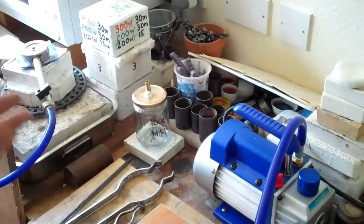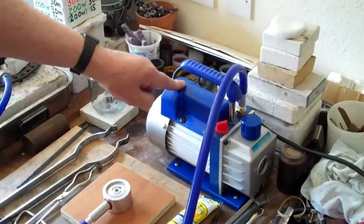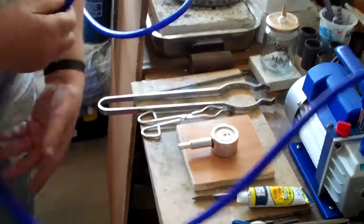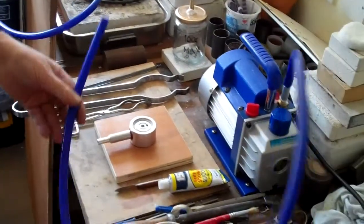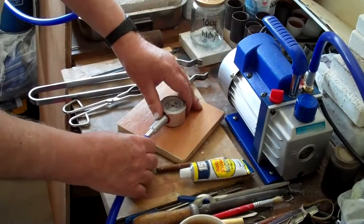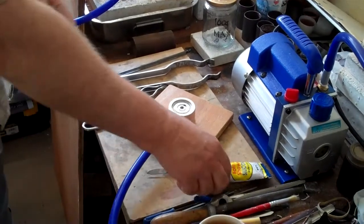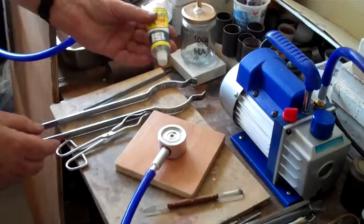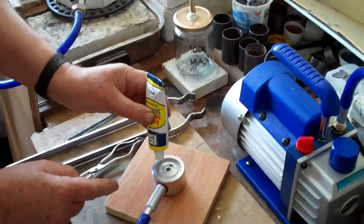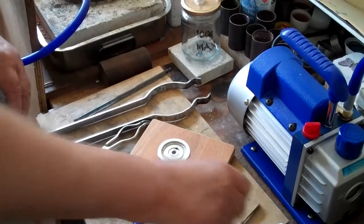So instead of needing two pumps, the single pump will do it because of the higher flow rate. When you're ready to cast, this is the total plumbing connection — just push the tube onto the spout and you're done. Make the seal with ordinary bath silicone sealant, a little fillet all the way around the inside rim of the table, and we're ready to go.